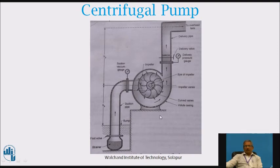A simple example: when the fuel in the fuel tank of your two-wheeler is totally used, if you fill the petrol or fuel in the petrol tank afterwards, the vehicle will not start because air is trapped in the pipe connecting from the petrol tank to the engine or carburetor, and that air will not allow fuel to enter the carburetor. The same case happens here — air will be trapped and it will not allow water to enter. Usually what we do is take out the pipe in case of the fuel pipe, remove the air, and then fit it back to the carburetor; then the bike will immediately start.